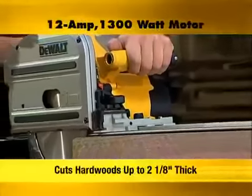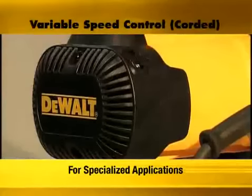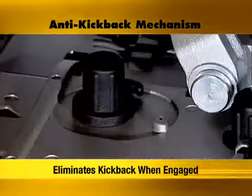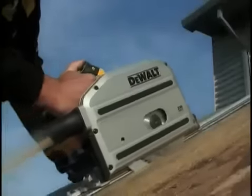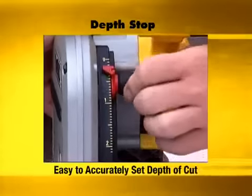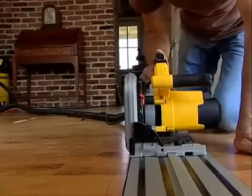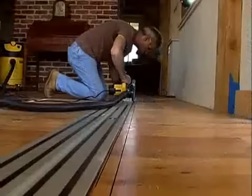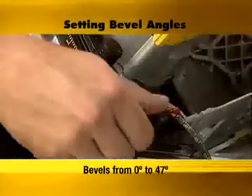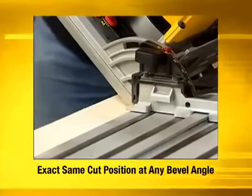The DeWalt-built 12 amp, 1300 watt motor allows the saw to easily cut through hardwoods up to two and an eighth inches thick. The corded version also features variable speed control for specialized application needs. The continuous anti-kickback mechanism features a forward feeding cam which eliminates kickback when engaged, and also means the track saw may easily be used on inclined surfaces without worry. Accurately setting the depth of any cut is easy using the depth stop on the front of the saw — the gauge indicates depth of cut in inches, automatically compensating for track thickness. This is ideal for applications where it's necessary to cut material without damaging the surface underneath. Setting bevel angles is as easy as loosening two set screws, selecting the angle of cut, and re-tightening. During a bevel cut, the saw continues to provide a splinter-free cut along the exact same line indicated by the zero clearance edge.